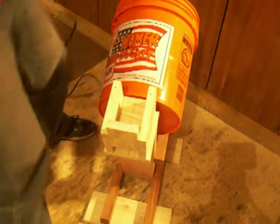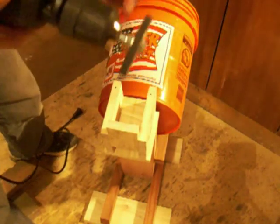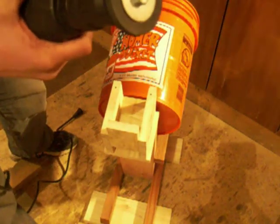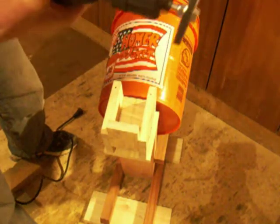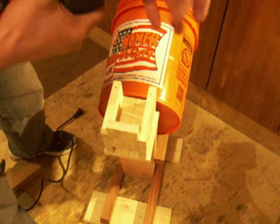Then we've got a piece of rubber — it could be a piece of a shoe, it probably doesn't matter. You've got a five-sixteenths bolt with two big washers and a piece of rubber cut round with a hole in the center. There's a nut on the inside, so I squeeze these two washers against this rubber and that's going to be your drive wheel.